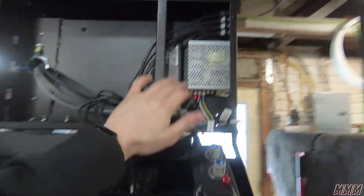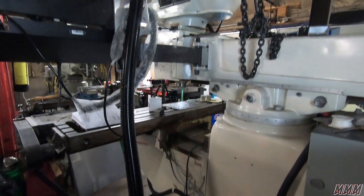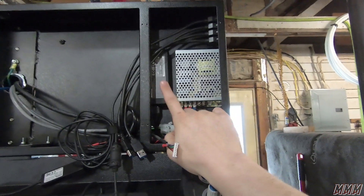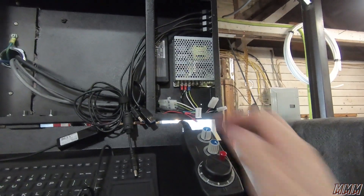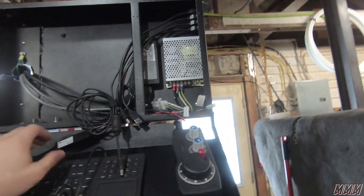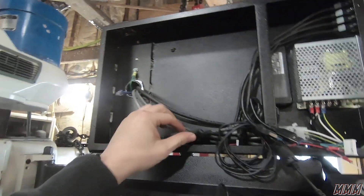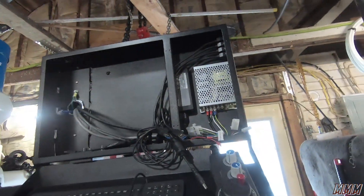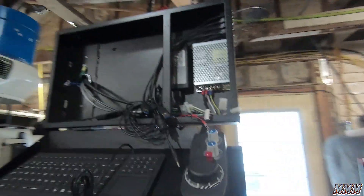It did not come with the power supply. Thankfully, the mounting holes — just two little screws on the back — are there. I got the same one listed in the schematic. I did some custom wiring; I cut my power supply for the NUC — cut the wires — so it's just sharing the 120 volt that connects to the Mean Well here. This actually comes with a little Ethernet port on the bottom, so I bought a USB-to-Ethernet adapter for the inside. That's good to go — I just gotta test my voltage, make sure that's good, and then screw that back on.